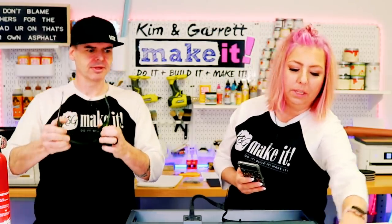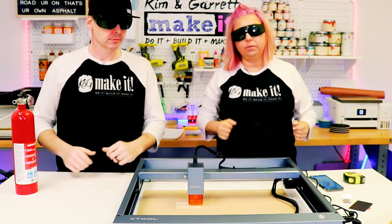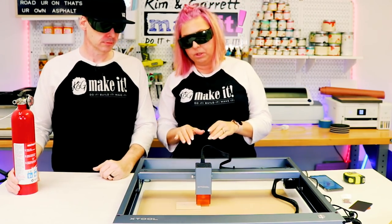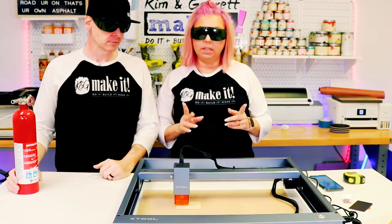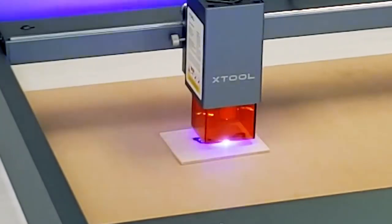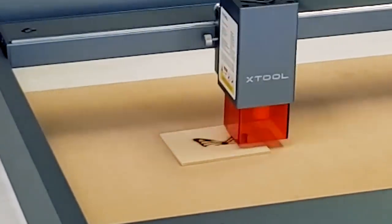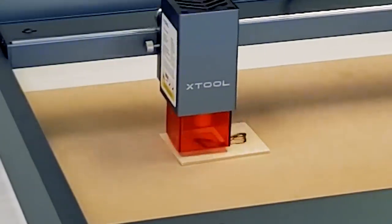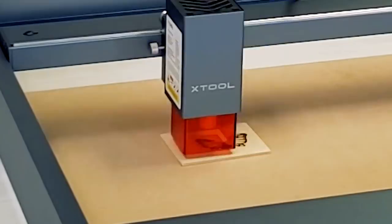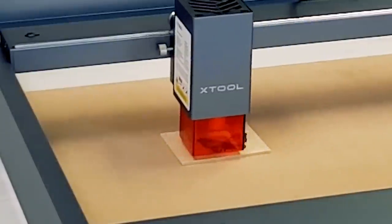Safety first — because it's a laser, you want to wear your safety glasses while it runs. It has a little orange cage around it that does some of the work to protect your eyes, but you should really have glasses on any time you're running a laser. I can smell a little bit of fumes so far — not too bad — but I'm a little worried because this room is inside and has no windows, so this is our test on how smoky it gets.